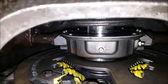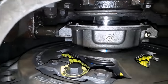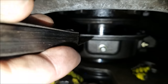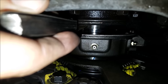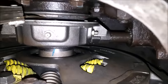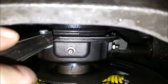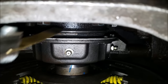Now we're going to check the clutch brake squeeze. Right there is your clutch brake on this side, and we're going to stick a ten-thousandths feeler gauge in between here — right here and right here. Have somebody press the clutch pedal down in order for this to be snug. Go ahead, press it down. See how that's snug right there? Barely release it. That's also in spec.